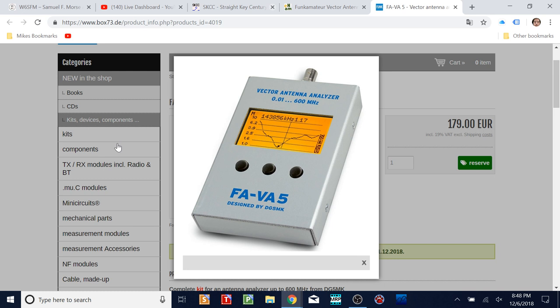The Rig Expert analyzer that would be comparable to that, it's a lot pricier. Like $900, right? No. It's $559 compared to this $190. It uses a true UHF N connector. Comes with some features like a SO239 adapter for the end connector, and it has a time domain reflectometer built onto it, a color TFT screen, and it's also a single port vector network analyzer.